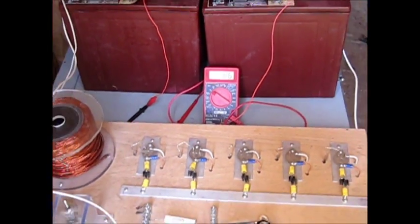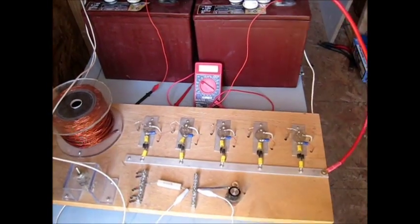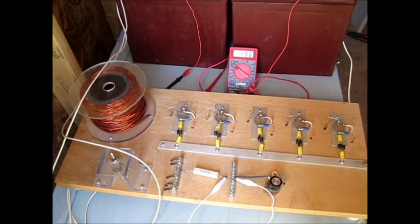Alright, so we're back to this little setup here. This one's been on the solid state for right at two hours now. Let's see if we can get inside and see what the image looks like — you can look down at the cells and see them cold boiling. Now this is where it's completely different from a regular conventional charger. When you see your battery boil like this hooked up to a regular charger, the batteries are actually getting hot. These are cold, and it's pulsing them.